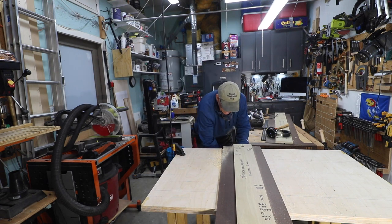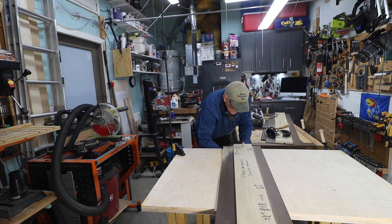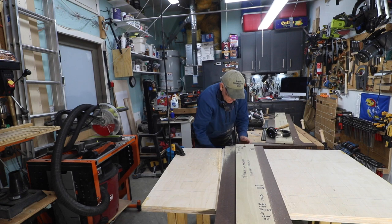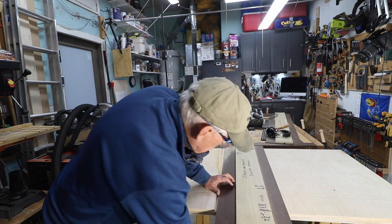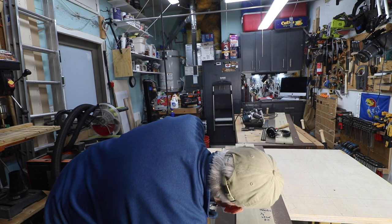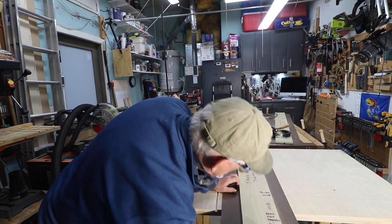All right, let's take a look at that. We did the preliminary cut with a 1/4 inch upcut bit. We did the second cut with the dovetail bit. So let's test it all out before we go using the same procedure in about 30 different grooves that we're gonna put in these Sawstallions.